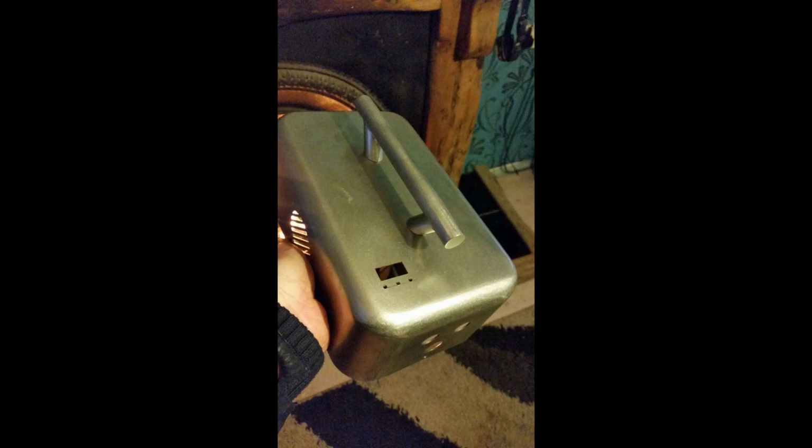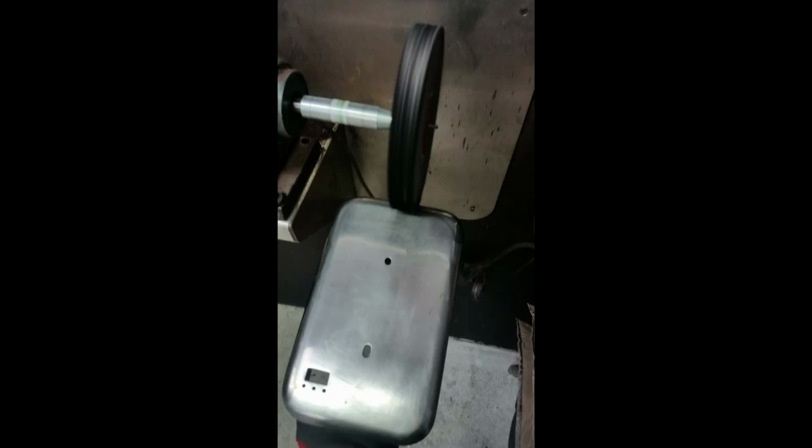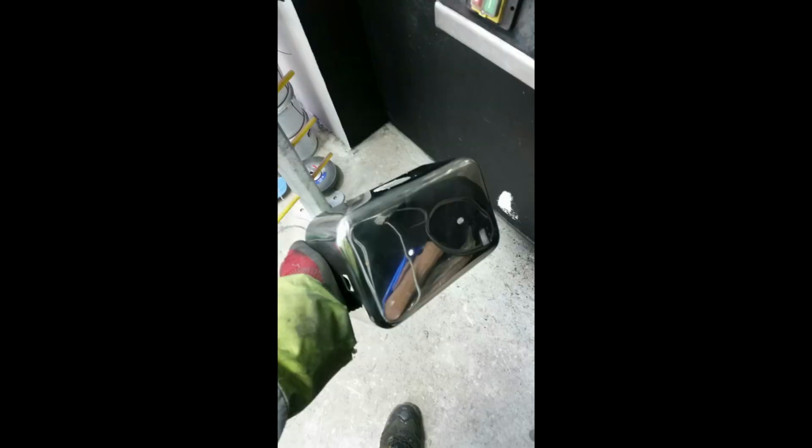So this has to be sanded again around this area and filed into nice square edges. All the extrusions had to be put on and wee tubes for the buttons. That's me starting to polish it with salsa weld, black compound, coarse, so that's polishing up to about 600 grit, right round. It's like burnishing. That's it coming close to the mirror.